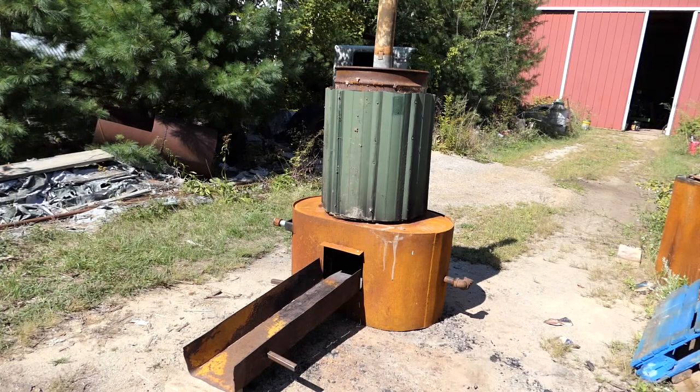The way it's set up right now is the way it's going to be used when you've got that green barrel all filled with wood inside that you're trying to turn into charcoal. There's a chimney that comes up through the whole thing, as you can see, that's in place. So I'm going to take that chimney apart, pull the lid off the barrel, and take the green barrel off of the top of the bottom stove part. What that is basically is a 275-gallon oil drum used for home heating oil. I cut about 24 inches and I cut a hole in the end of it so that the fire can go up through there and superheat that upper barrel. I pretty much left everything — the filler pipes and the legs and everything on the rest of it.